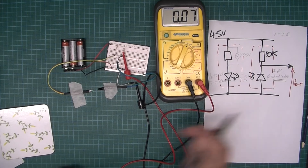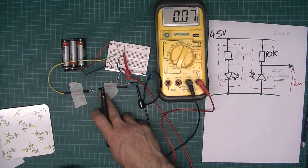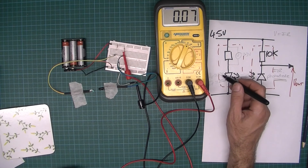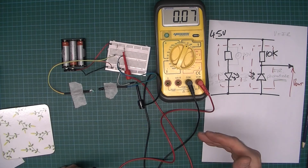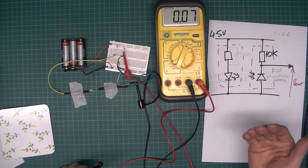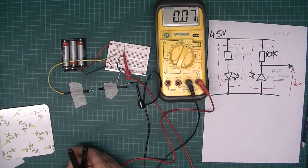You need an infrared photodiode that's reverse biased and an infrared LED. They're always clear, but if you're given a pair, the detector is the black one — it's black because it blocks visible light and allows infrared through. Be aware that the infrared emitting LED has a forward voltage drop of about 1.2 volts and a forward current of about 20 milliamps. This is a possible alternative to a motion sensor or contactless sensor. What you're detecting is that a logic high has gone to a logic low — meaning something has gone past, blocking or bouncing the light.